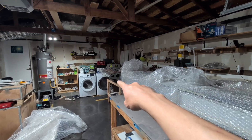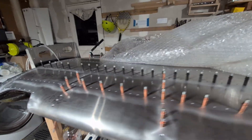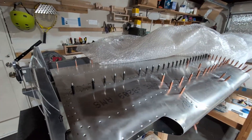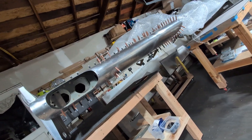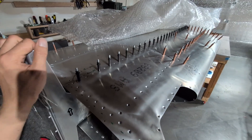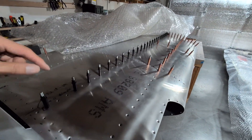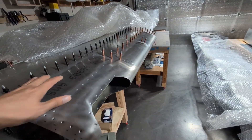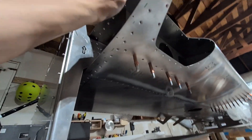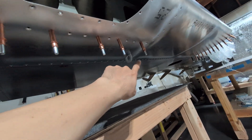I have been drilling out the rivets from the right wing for the last almost two weeks. The top side has been finished, and I've been working my way through the bottom side. I still need to drill out this entire section of rivets in order to replace this skin. As you can see, I finished the top section, and most of the rivets on the bottom are still here — I just started drilling out this row.